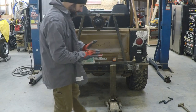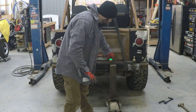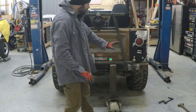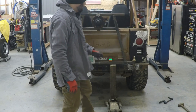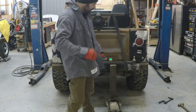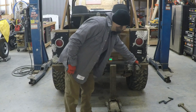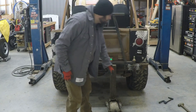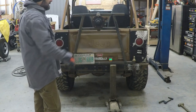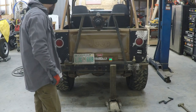Alright, I got it setting up here. I got it leveled out with the jack. I used my little angle finder — put it on the bumper, then put it on this, and got it within a couple of degrees from the bumper, so I like it. The jack's holding it up and I've got a C-clamp holding it to the bumper. So I'm going to put some pretty decent tacks on each side of this. Then I can take this thing back off, weld it up, start plating it in, and then we'll be done with this thing.